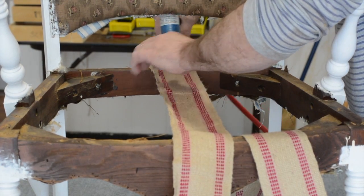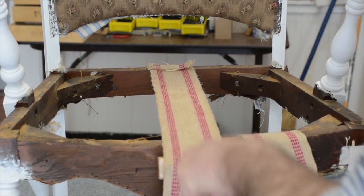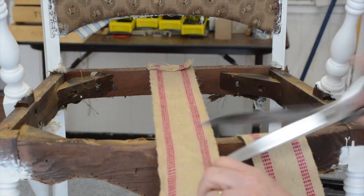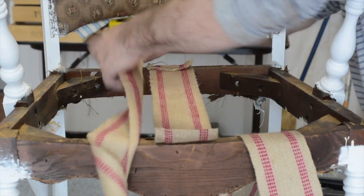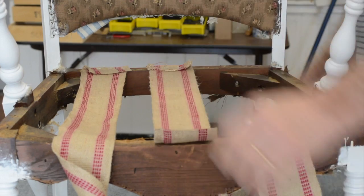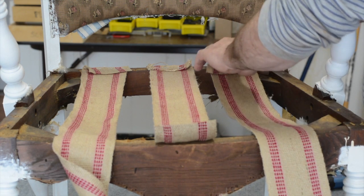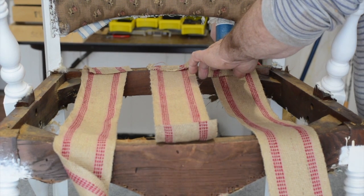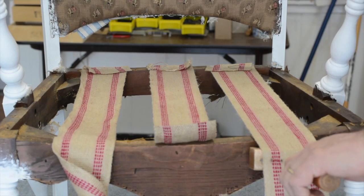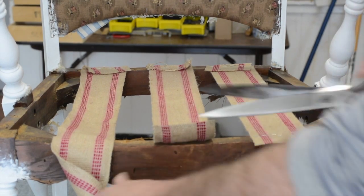If you're doing three front to back, which we're doing here, we're going to start in the middle and give this a good stretch with the webbing stretcher. In my other videos I've shown you how to use those. We want drum tight. Each layer, starting from the very bottom layer, determines what our outcome is going to be with our fabric. So it's very important to start on a saddle seat front to back and get a good stretch on these webbings — it's really the only heavy support.